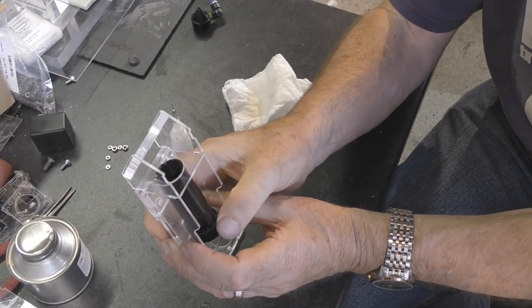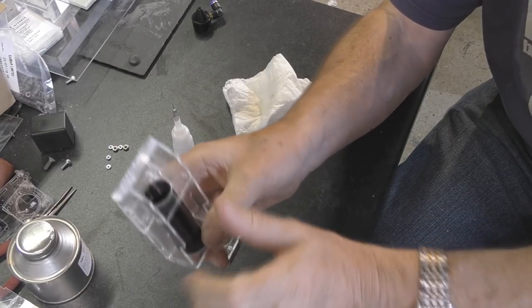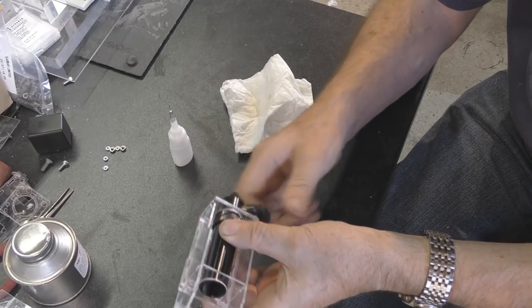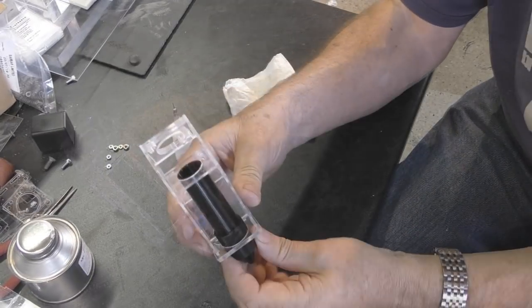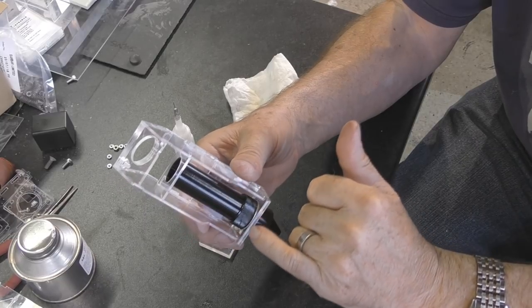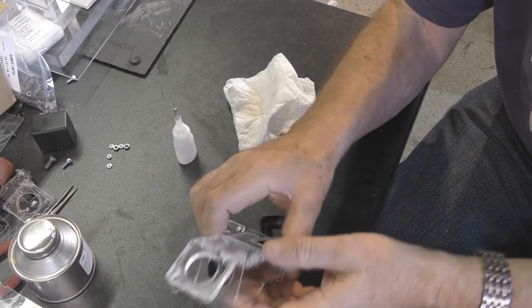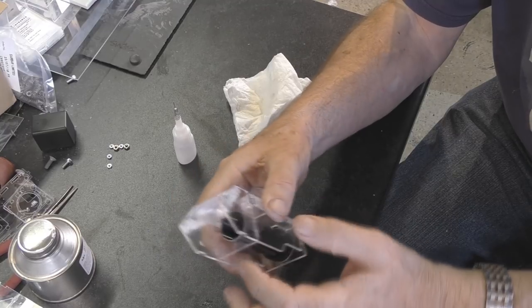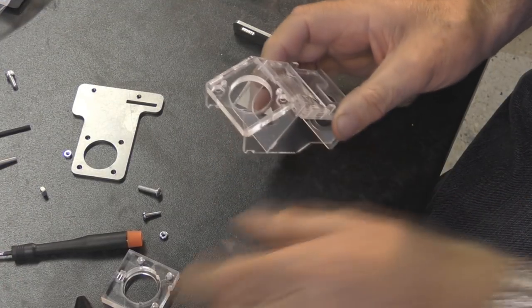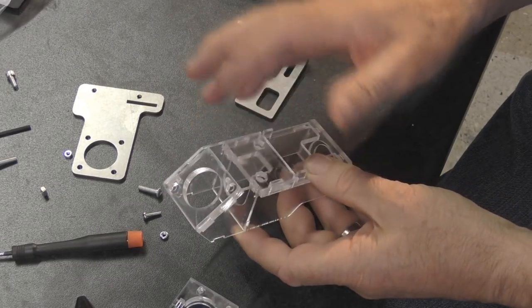That really is all the assembly work done. We can see that this lens tube sits snugly in the bottom and should rotate freely. It sits flush more or less with the top, and then this nozzle should screw in at the bottom and clamp the whole thing together. As we clamp these two pieces together we're locking this onto the two-millimeter acrylic at the bottom — it's central both ways and held in line because it's pressed against the back edge and held in place with this U-shape, which is a snug fit.